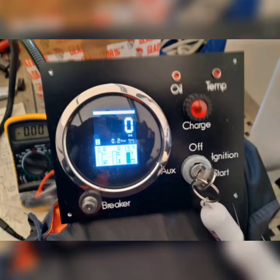Having connected these two, we can then plug in the panel, and the panel bursts to life. Not very much life at the moment. What we're doing is showing that the voltage is just over 14 volts. The boat owner was very happy with this because he was charging his batteries while I was doing this work. I was working on a live system. I do not recommend that you work on a live system. I recommend that you disconnect the battery and reconnect it for each testing phase.